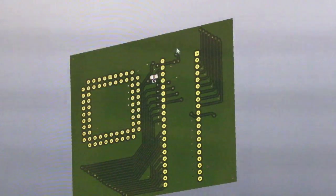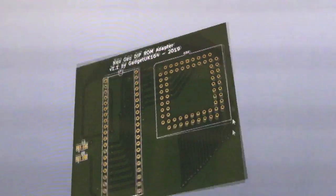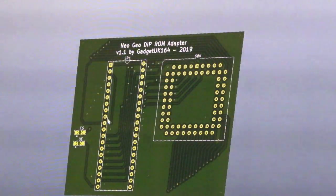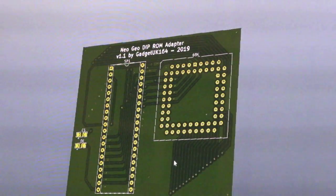And you can see, I've got a lot of ground plane here. Now, in that first version, the ground plane wasn't as tidy and as neat and as optimised as it is in this version here. Actually, it came out quite well, and that was from my experience of the original board. So in some ways I was lucky that that first one didn't work because it wasn't that tidy. I mean, the one thing that could be improved on here is to have some ground plane between these traces and these traces at the top.